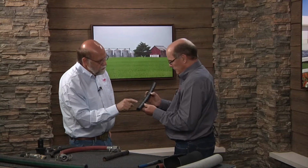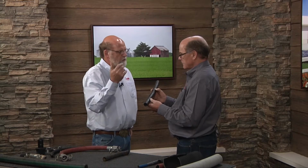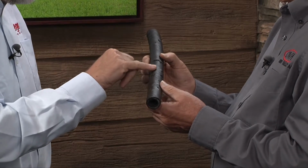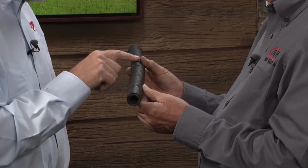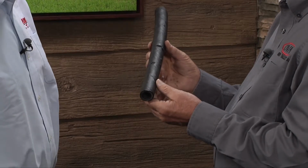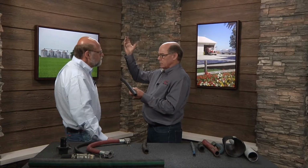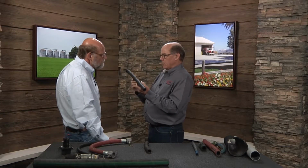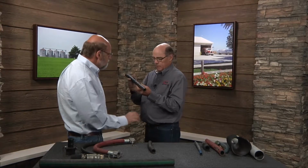So what I see is a lot of these where this hose is moving fluid of some kind, but what's happened is something's leaking on it, and it stays leaked. And it looks moist and wet, and I've had this now for a long time. You can see the oil, it's just totally saturated. If you remember the old overhead fuel tanks that were gravity fed, and the hose that hung down from them, you have this type of hose on it, and it would literally leak right at the bottom of that curve at the bottom of the hose. They penetrate it.